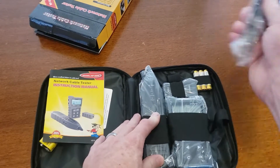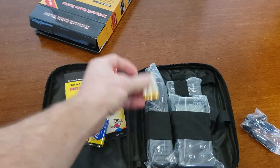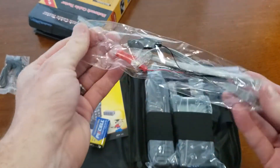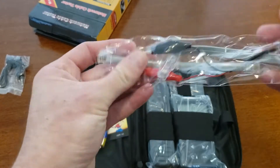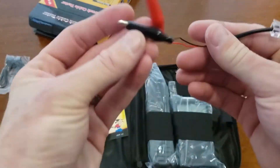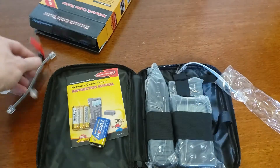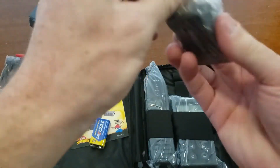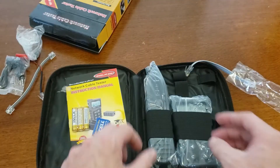Everything's wrapped up, that's nice. Comes with another set of batteries - some of these are probably for this piece here. It even has a little thing for the batteries. There's also a little hearing aid earpiece so you can hear it if you need to. It comes with jumper ethernet cables so you can wire test too, that's pretty cool. And this is a phone connector - you can jump and test continuity on phone cables too, test for shorts or signal. Here's a little adapter piece as well - that's labeled wire map.